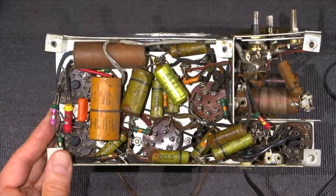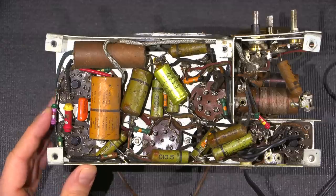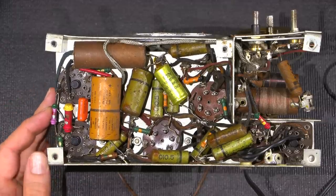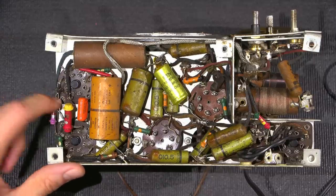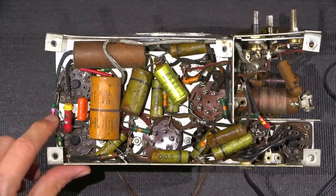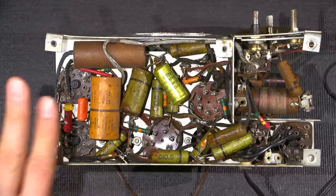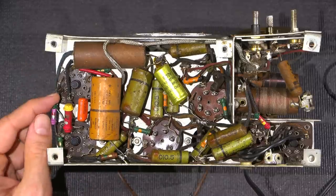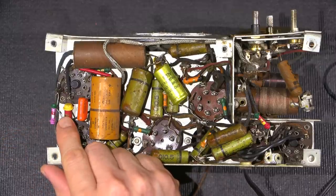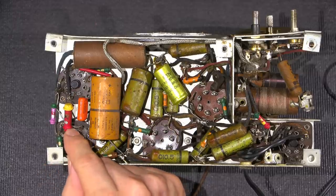These resistors are known as dog bone style resistors, and you can read them by remembering bed, like the bed you sleep in: body, end, and dot. So the body on this resistor is purple, which is 7. The end is green, which is 5. And then the multiplier is red, which is the number 2. So whenever you see the multiplier, you replace that number with zeros. So since that's the number 2, put 2 zeros there. So 7500 ohms. You can see the multiplier here is brown, so that's the number 1. What do we do with that? We replace that with 10. So again, body, end, and dot.